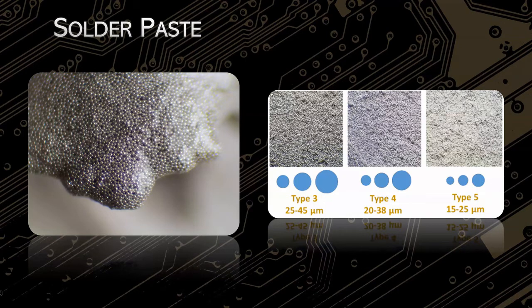I've heard you can't really store this stuff on hand for too long. What happens? With water-soluble fluxes, the moisture in the air combined with the paste will slowly leach away all the moisture and you end up with a dried clump of solder balls — it doesn't work well and doesn't reflow well. It's very important to follow manufacturer recommendations: store it in a fridge, keep it in an airtight container. One advantage of no-clean flux is it has a much longer shelf life and a much lower risk of degrading over time compared to water-soluble.